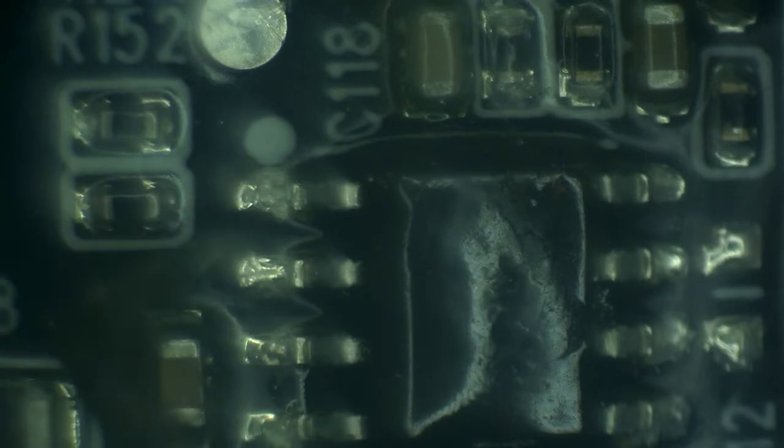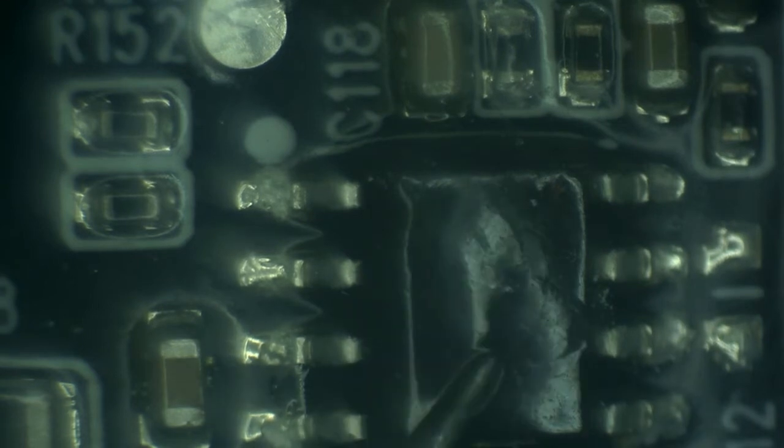All right, so hopefully you can see this guy. Again, it's covered in conformal coating. We don't have to worry about it for now, but it's one of those hard to find buck converters that takes very high voltage, up to 60 volts, I believe, 50 some volts, and can make it as low as 3.3 volts. Again, it's got a built-in MOSFET inside, which is usually an annoying thing, because they're usually not the greatest quality, and when they fail, the whole thing fails. Looks like it's moving fairly good, but conformal coating is likely holding it in place quite a bit.